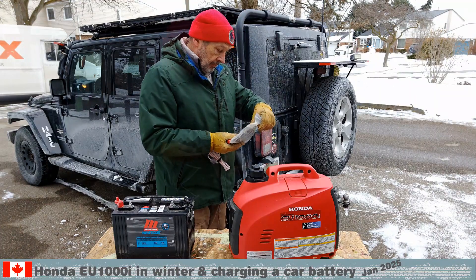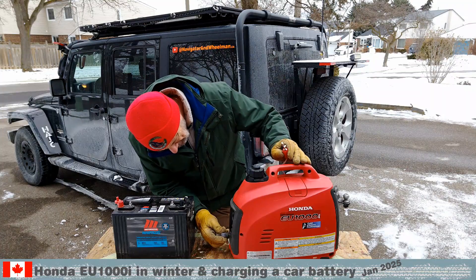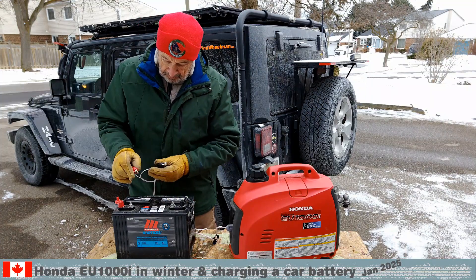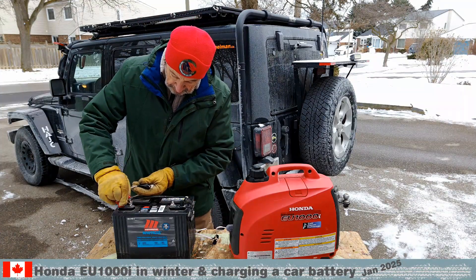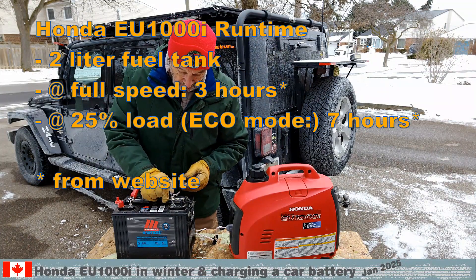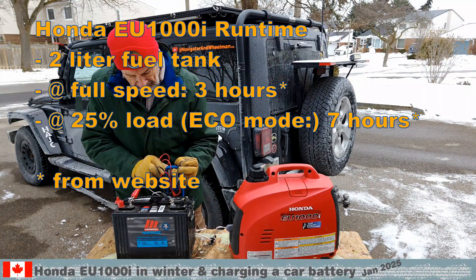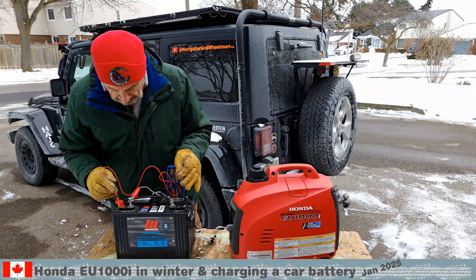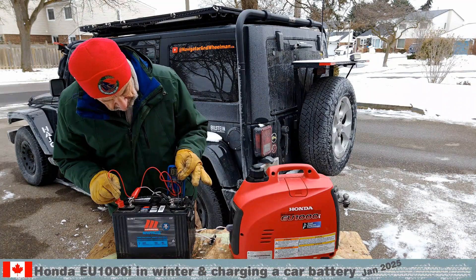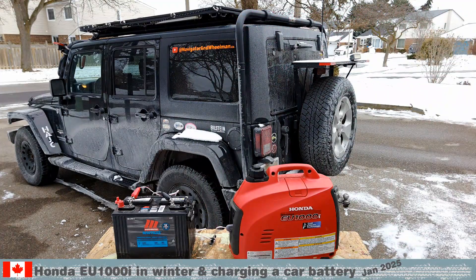We found out the hard way to keep a few spare fuses around. Some appliances may work fine until they are under heavy load, and this is when the fuse blows. Plug in the cable, connect the plus and connect the minus. The generator is now running in eco mode. It delivers 13.7 volts in eco mode and 14.1 volts with full speed, or eco mode off — that is the voltage as expected and within the range for car batteries. The first test is completed successfully.